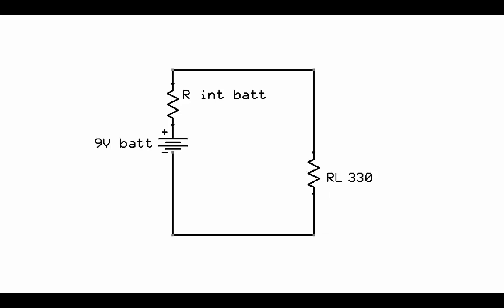But what you have to realize is that all batteries have internal resistance. That results from the battery's chemical composition, the number of cells, the connections between the cells, the size of the electrodes, the type of electrolyte, the temperature, and all those conditions. You can think of it as just a single series resistor in series with a perfect battery. The battery voltage measured at the terminals with no load is the maximum voltage the battery could ever provide, but the voltage available to a load will always be less, because some voltage will be dropped on the internal battery resistance.